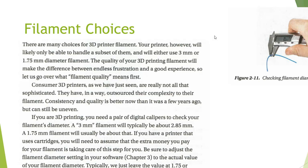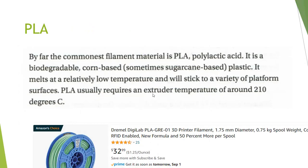I recommend that you get a set of digital calipers so that you can check and take measurements. Typically you can buy filament in two different sizes: 2.85 millimeter or 1.75 millimeter. We typically use the 1.75 millimeter filament. Larger printers will use the larger diameter. On Amazon, if you purchase PLA — which is a biodegradable, low-cost printing material — it's about $30 per coil, and you can get it in a day. The problem with it is it has a relatively low melting temperature, so you have to be careful about using this material for anything designed to be put outside.